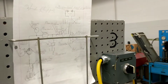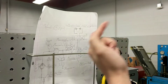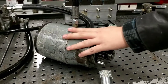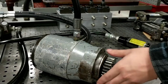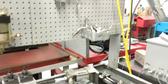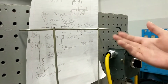As you continue along, you can see you can adjust it with a lever, and it's our bidirectional motor. In this case, we have a piston motor, and pretty much it's high torque, low speed. Generally it's run at lower speeds, but for the application of a wood chipper, it's awesome. And of course, we have our return line, our return line filter along with the bypass, and that goes back through the reservoir.